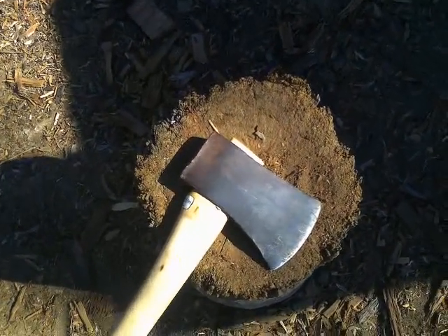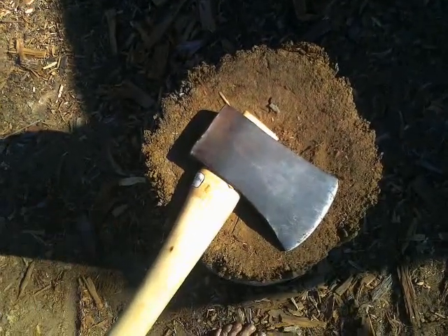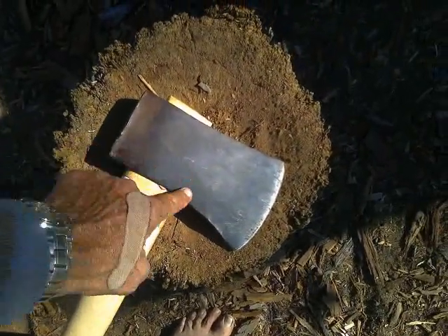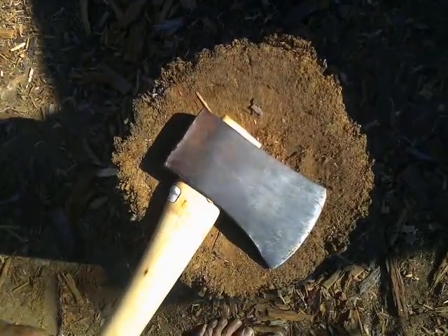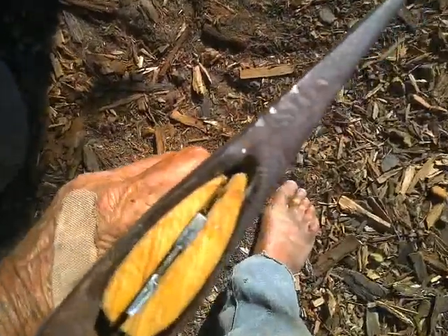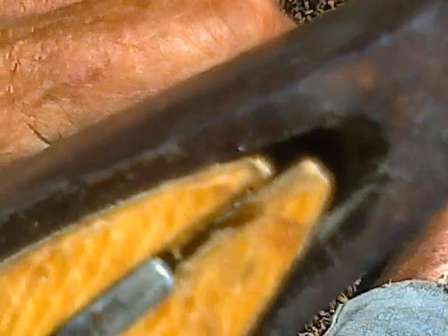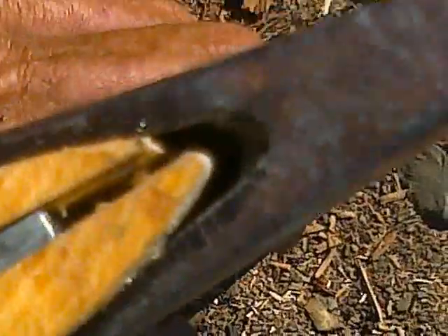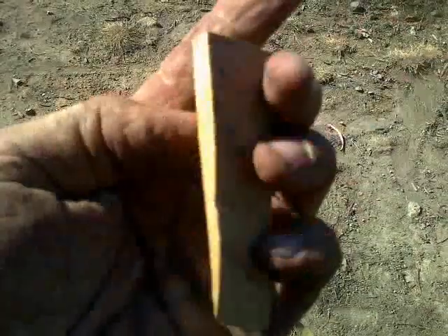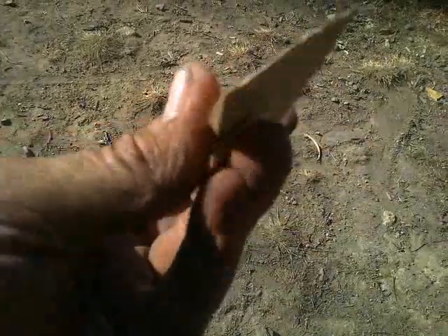Which is probably why for the last 20-odd years it's become fashionable to mount axe heads with all sorts of epoxy to try and fill this, and I think it's a reasonable idea. In this case, what I decided we really need is a sort of a complicated curved U-section wedge to go between the hickory axe handle and the gap in the front end of the eye in the axe head, because a wedge like this just is not going to cut the mustard.